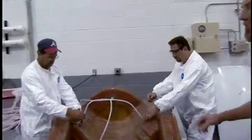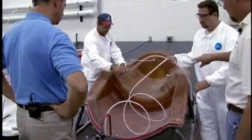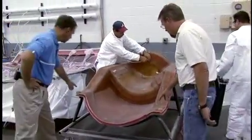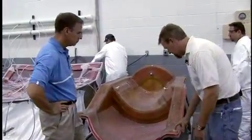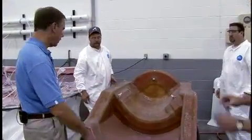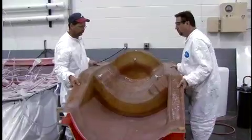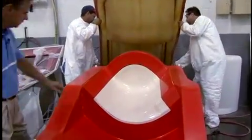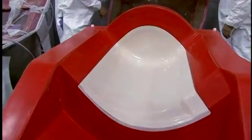Let's go ahead and take this off and show them a door that's in there. That is a serious looking mold — it has to do with seals. Vacuum is pulled all along here, forcing this mold down to specific stop points — like registration points that keep everything aligned so you know exactly what thickness you're getting. And there you have a 240 head door — finished, ready to go.